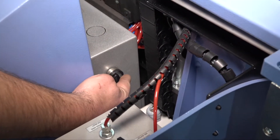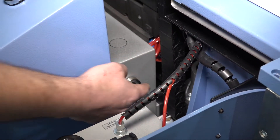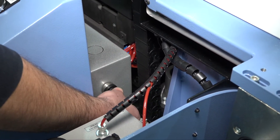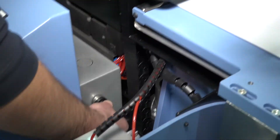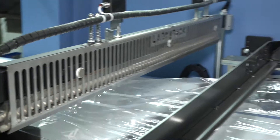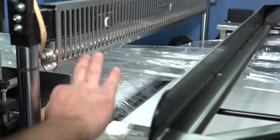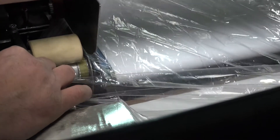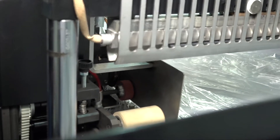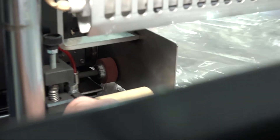Now open the rotary side sealer with this button. You have to open the rotary side sealer to make the two layers of the film go through it. Pull them with a slight tension under the driving rollers of the rotary sealer. As you can see, there are the two driving rollers and the two metal plates — the two layers of the film have to go through the two plates.